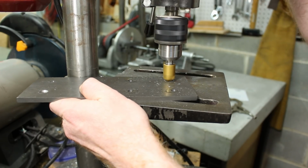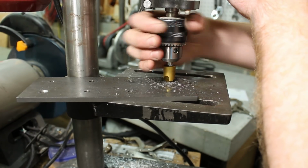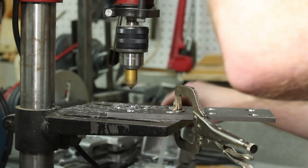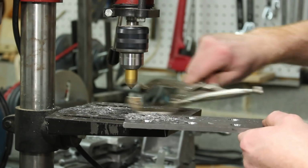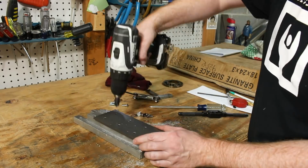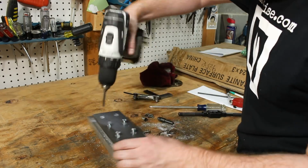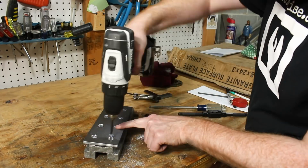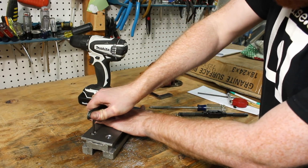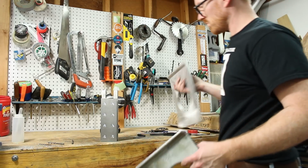Went back and started the countersink at the right angle, but got a ton of chatter. So I tried just doing it by hand. I already had it on the slowest speed of my El Cheapo drill press, but yeah, that 3-flute countersink just chatters like crazy. So maybe I can slow down the speed on my drill press, or I don't know, just tap it by hand. Maybe put it in the brace that I've got hanging on the pegboard.